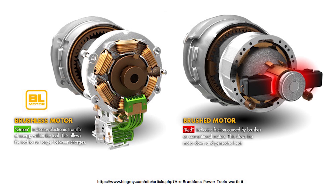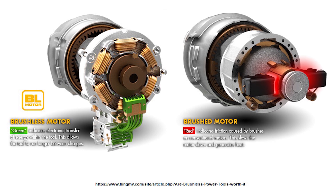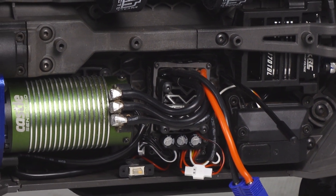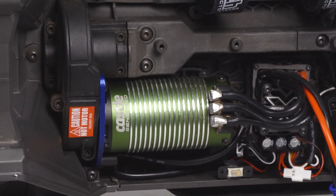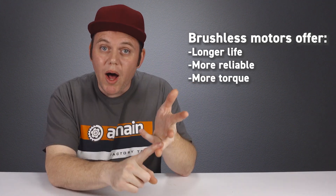The third motor type, commonly found in really high-end servos, is the brushless motor. With brushless motors, the mechanical parts used in brushed motors are removed and replaced with electronic semiconductor switches, making brushless motors very simple and extremely hard to wear out. If you have a brushless motor in your RC model, you know that motor will just run pack after pack almost indefinitely — requiring pretty much no maintenance and lasting almost forever. Brushless motors in servos are no different, offering longer lifespan, increased reliability, and increased torque per watt of power output. The downside is they're expensive, but as some people say, you get what you pay for.